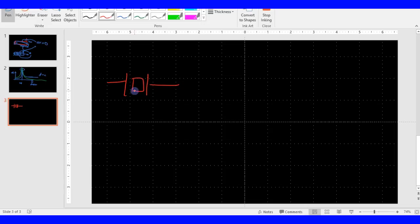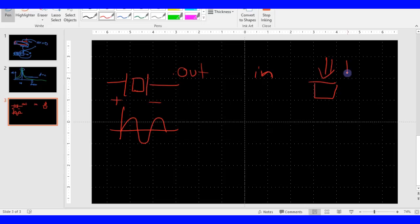and it is developing some type of alternating charge, because if you press on a piezoelectric element, you can only theoretically get out what energy you put in. You can't get any more energy out than you put in. So if you just simply push a piezoelectric element, you are limited to one push. But if you are pushing, let's say, 20 times a second, then you have the energy from 20 pushes that you can gather. So essentially all, if not almost all, piezoelectric energy applications will be operating in an AC form, with some type of cycles, pushes per second, or deformations per second, or cycles per second.